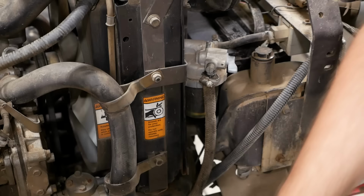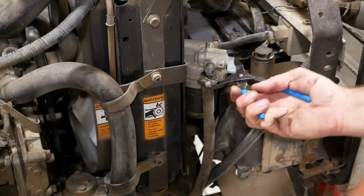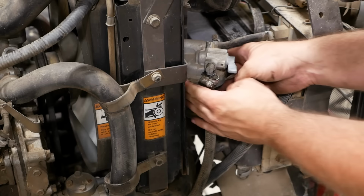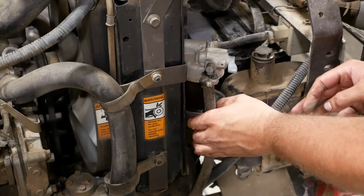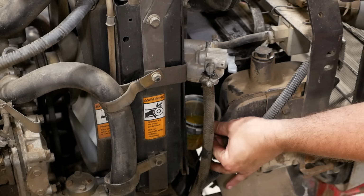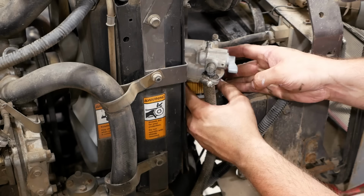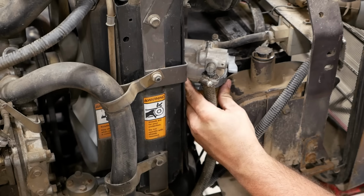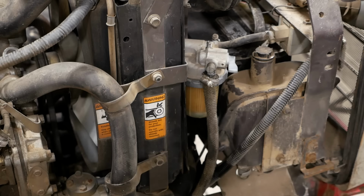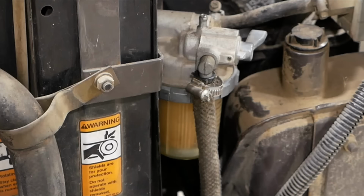I think we'll do the fuel filter first before we start it. And then once we're sure it's gonna work, we'll do the engine oil change. Just because we've already had this line off, I don't want to try to bleed it twice. Worse. Well, at least it was on camera. Now it should have a bleed position. I think if we flip it to this guy, it says air. And we needed rain.